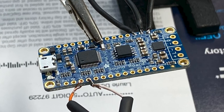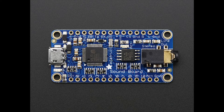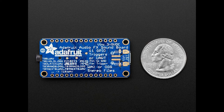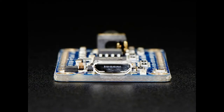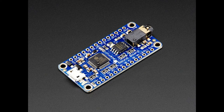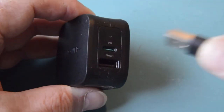To accomplish this, I used a sound card from Adafruit and a small powered speaker. I recommend the 16MB version of the sound card, as the 2MB won't have enough room for your audio files. This board is easy to use and no real programming or microcontroller are needed. You have some control over how the files are played simply by how you name the files, and I'll go into more detail about this a little later. Let's go over the connections. First, you need to power the sound card. There are multiple options for doing this. I used a micro USB cable and a phone charger.